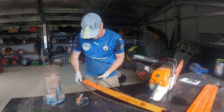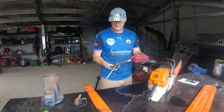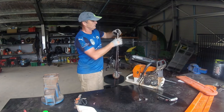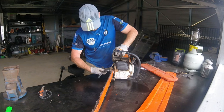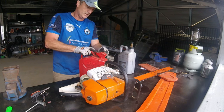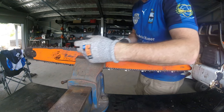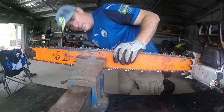Let's get the bigger bar out. For your reference, I have a little medical kit just on a clip with my bar wrench — almost always you can't forget to take that with you. This chain's pretty sharp anyway but I'll give it a quick sharpen. Bailey in the background is busy entertaining himself chasing a brick. I think I'd better mix some more fuel as well for today because you certainly go through fuel when you're milling — the engine's running on full bore the whole time. Since this is quite sharp already I'll just give it a quick tickle up to re-face and clean it up.